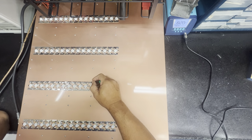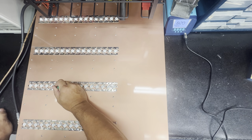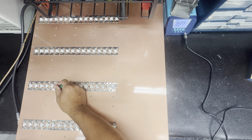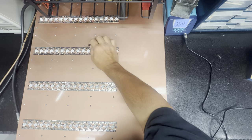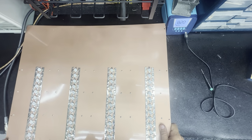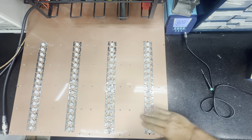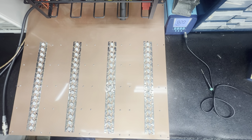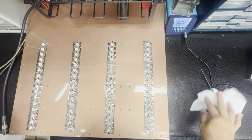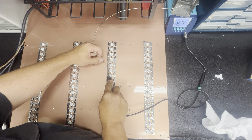Screwdriver here. Yeah, if you let any of these circuits right here run together, or one little piece of solder, you've got problems. There's a piece. I'll probably blow it off, wipe it off with the rag. Y'all stand it up, blow it off, wipe it off. Take a paper towel, rub on it. Any solder splash, get that off her. Oh, look right there. That's why you gotta double check. But I'll catch it when I put transformers down.